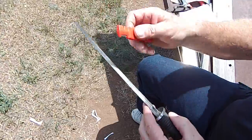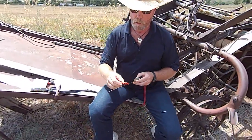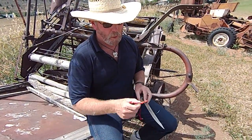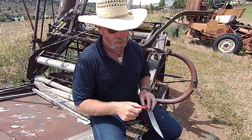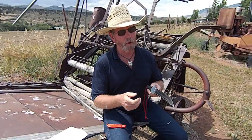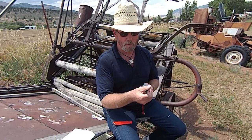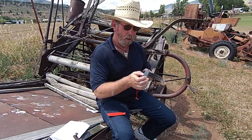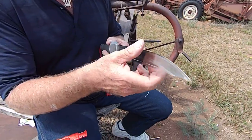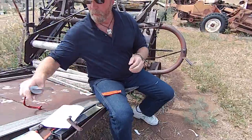When it comes to polishing the blade, I slow down and I touch it very deliberately, very light, just like this. 20 times total, about 10 on each side. Really light. Now, yes, you could get a 1,000 grit stone or something like that, and you could make it even sharper right at the cutting edge. You can't really feel a wire edge on my knives. You go along and up like that, then turn it over and do the same thing, feeling along here. So they're as sharp as they need to be.